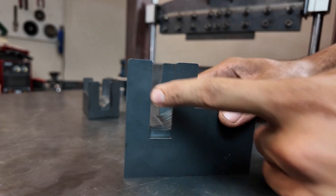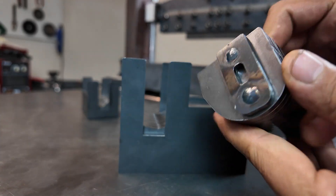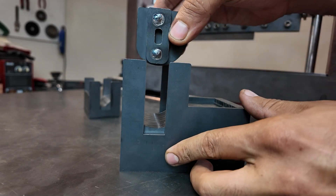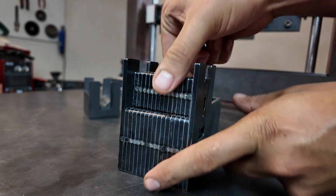The sheet entry edges on the punch should never be sharp, so the material doesn't get damaged during bending. The second point is that the punch and die must be perfectly aligned with a guiding mechanism, so the bend comes out correctly. For my setup, I used these two pieces that fit together like male and female parts, and they worked really well.